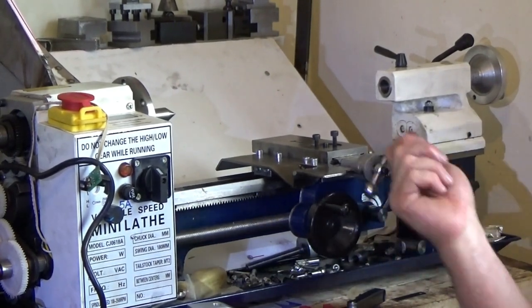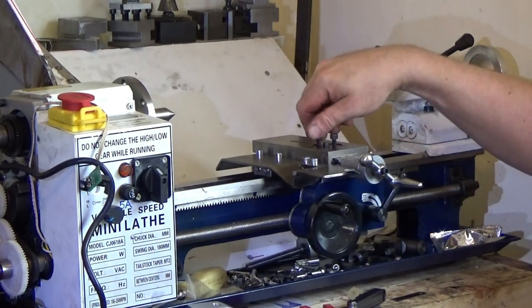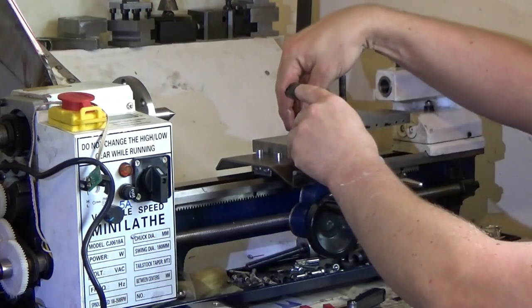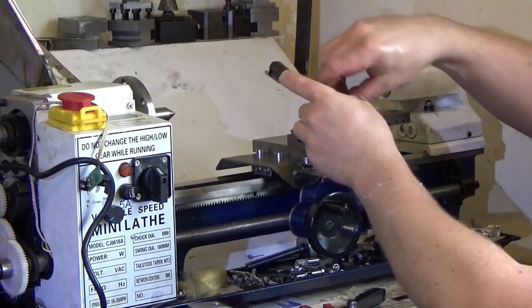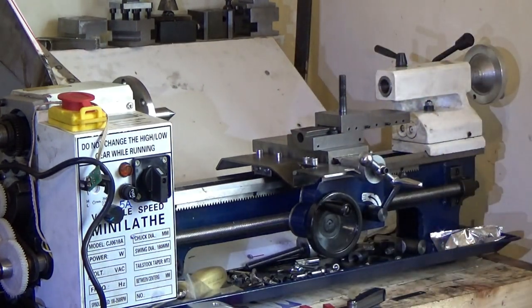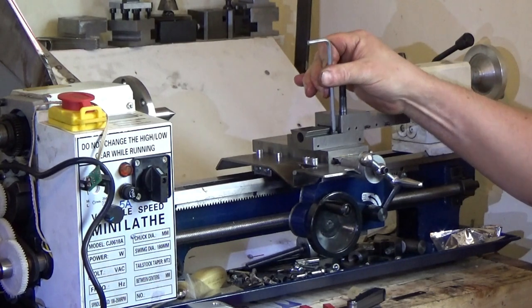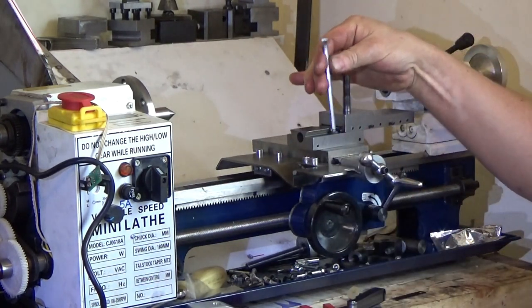Excellent. I've cut two bolts to size. These are about a millimetre longer than the other ones. So, let's see. Oh, go in and don't bind up. These are the two criteria for these, because if they go through too far they will bind up. And that will come out back a bit further, there we go.